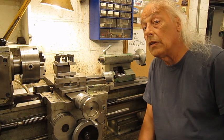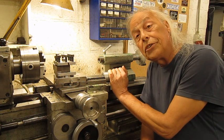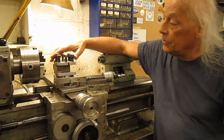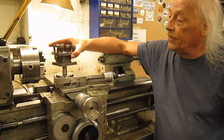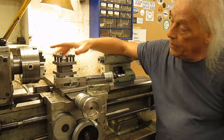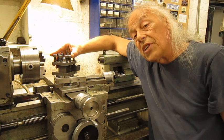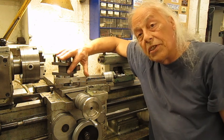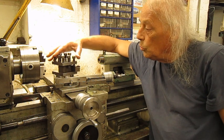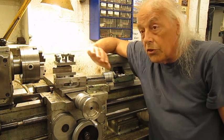I have several little problems with this machine, so I decided to pimp my lathe. First of all, we have this tool holder. It's holding down on a cylindric part, and at the corners there's too much stick out, so several times I have had a chatter problem just because there's not enough rigidity in this system. There's even two of these four corners that are a little bit bent down,